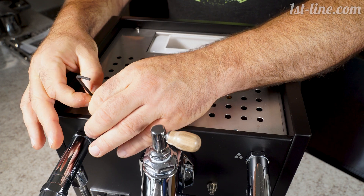Make sure it's cold — this machine is actually hot, but make sure it's cold before you open it. If you have the water line plumbed in, make sure to shut the valve off for the water. When putting the screws back in, I like to leave the tank in place, because if a screw falls on the side here it's easy to retrieve instead of going deep down.